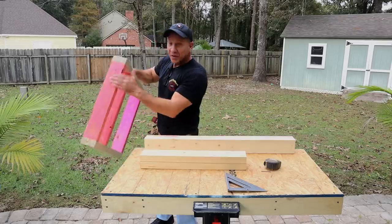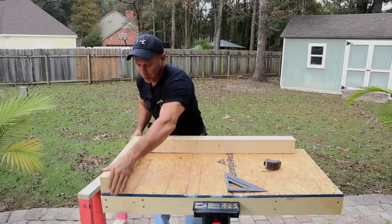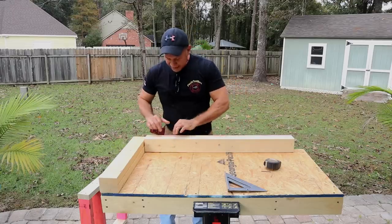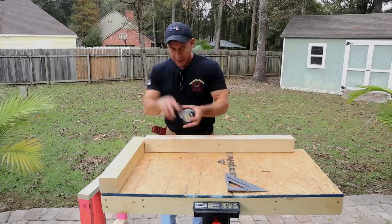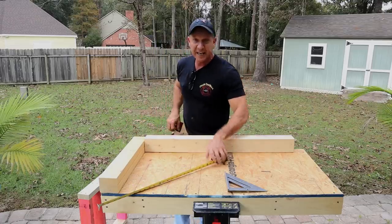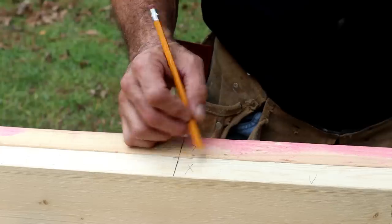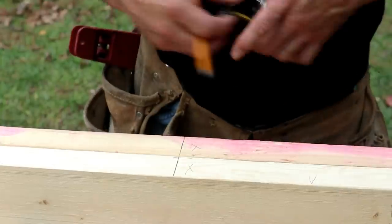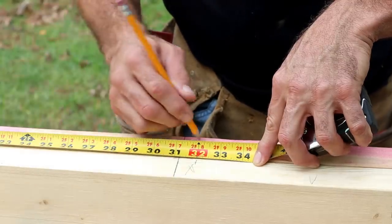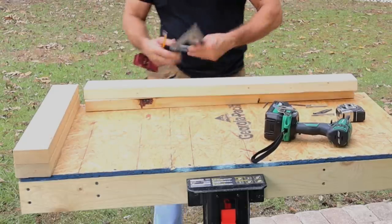This was just made for demonstration purposes, so I'm going to set it aside. I'll grab my base and top plate from my sides, put them back right on the lines I marked — it matches the edge, super simple. Here's my base and top plate for my back wall. I'm not going to measure from that; I've got to measure from the outside wall. Always put your X on the outside of where you're measuring — you'll see exactly where that red mark is and know that is where the stud center should be. Then I'll transfer my marks over.